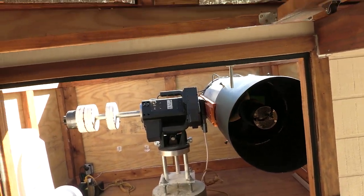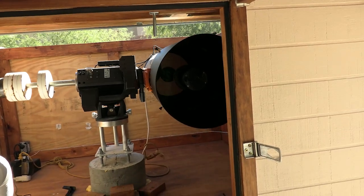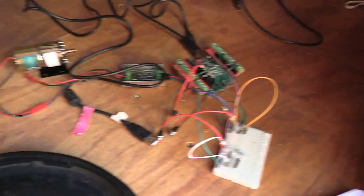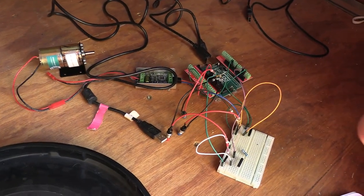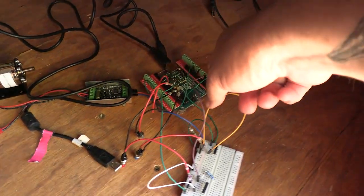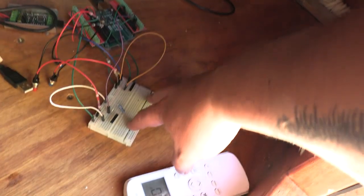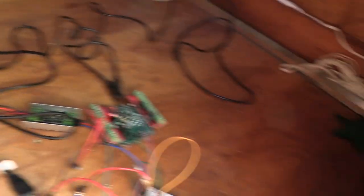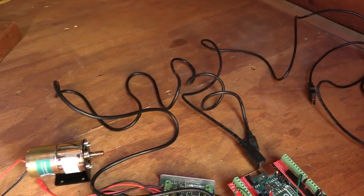The next upgrade I'm working on is an auto roof opener. This is the setup — it runs in KStars and EKOS with INDI. It's called Roll Off Roof INO, and you load software onto an Arduino Uno and install sensors. I have two reed sensors that are magnetic switches — one for open, one for close — plus a 12-volt 10-amp DC motor controller and a high-torque 12-volt motor. This has all been tested and is set up and working. I just need to install the rail and print the gear that drives it, and I'll be able to fully open and close the roof from inside the house.